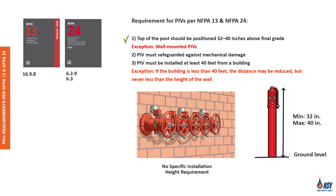However, wall post indicator valves must still be positioned so that they remain easily accessible and can be operated quickly in an emergency. The height above ground should be reasonable and convenient for operation. Post indicator valves should be installed in locations where they are not exposed to potential impact or mechanical damage, but when positioned along roadways or in areas where they could be damaged, proper protective measures should be provided.